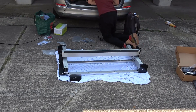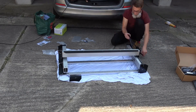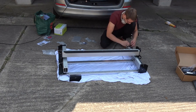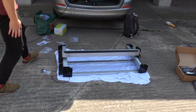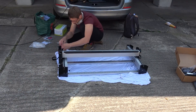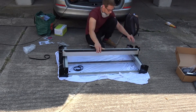Now was time to install the X axis which will also later guide the router and the Z axis motor. In comparison to my Snapmaker, the Shapeoko is belt driven which was pretty new to me. These are the black bands you can see me installing right now. Those gave me quite a bit of trouble since Winston Moy's instructions weren't clear enough on how to tighten them properly and if I needed to cut the overhanging parts off after installing them. But after reconsidering, I simply cut them off.